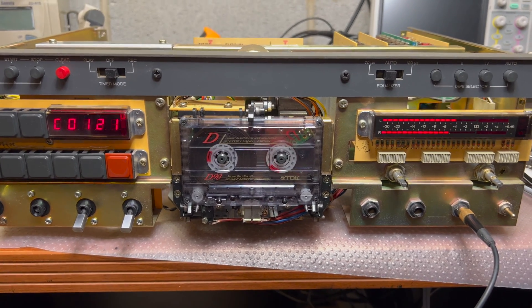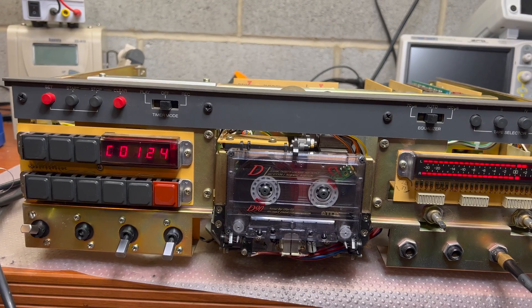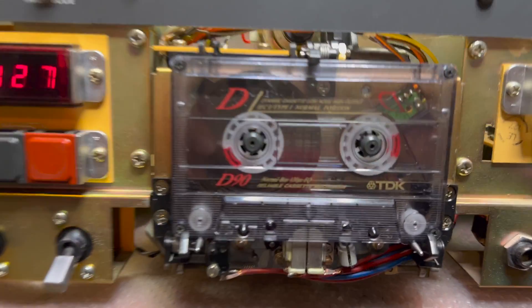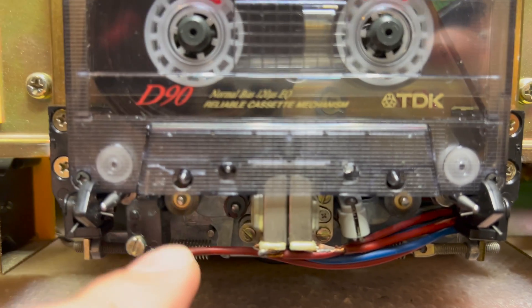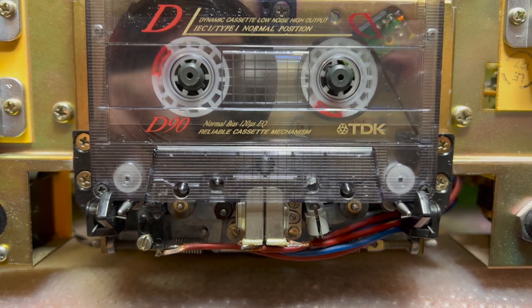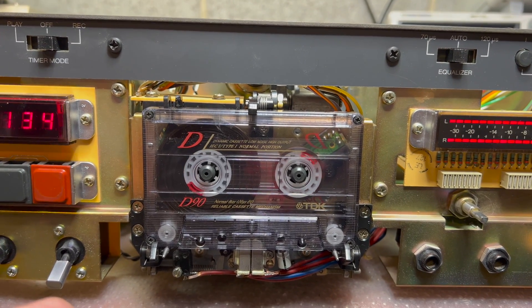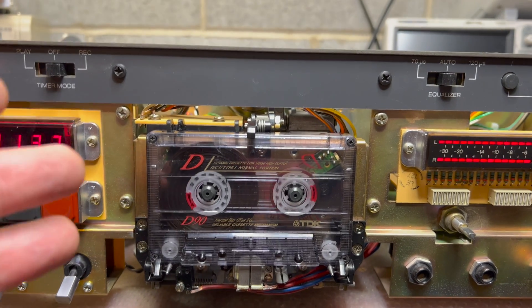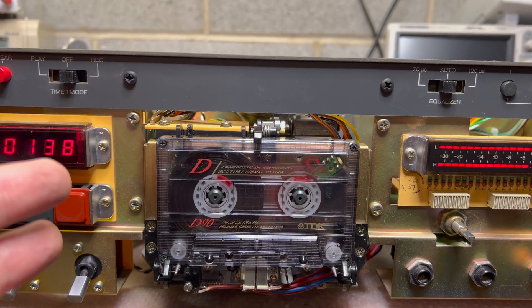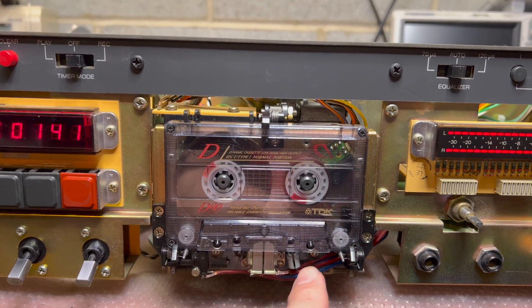One more observation: I measured the speed normalized. Wow and flutter is gone, and we're playing with old rollers — I haven't fixed them yet. I'm still waiting for new rollers to come from China, but it works pretty well now. No more issues. Everything needs to be reassembled and assembled properly. Wow and flutter is gone — it was not the pinch rollers as I thought.